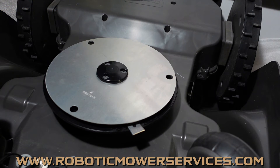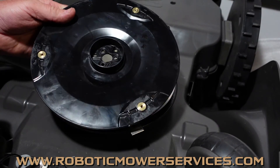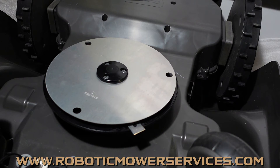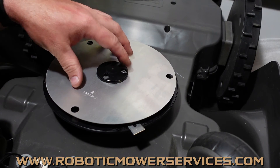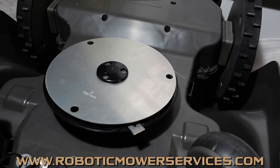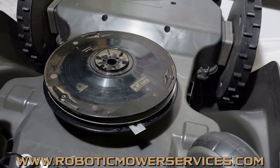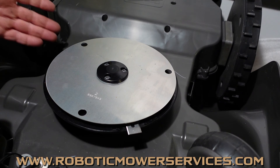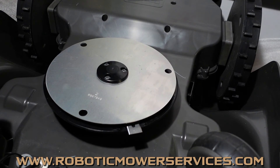We make sure anyone buying for an older mower — which used the taper-headed screws — gets the right screws, because you cannot use taper-headed screws on the new style cutting disc. One way to tell you have a new style cutting disc is there are no tapered holes. You can also tell because it has a number '2' marked on it. There's a number '2' on the shield as well. So hopefully this has been some good information. If you want to improve the cut of your automower and get more out of your blades, this is a good place to start — order the new style cutting disc and the shield to go with it.